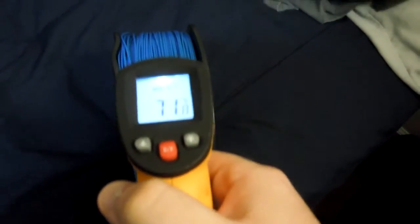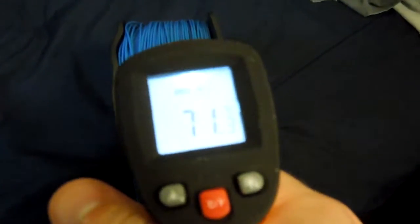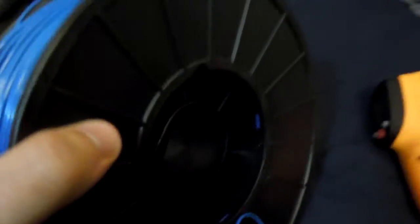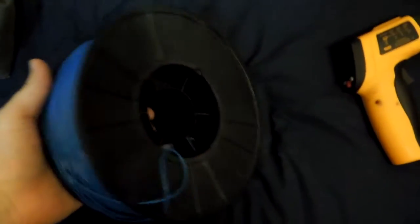If I pull the temperature — I just pulled it out — it got to about 90 degrees C in there, and the outside is a little bit more than that, but it's been cooling down. So it was about 90 degrees while it was in the oven. You can see that there's some deformation of the actual spool itself — it was sitting in the oven and kind of drooped down. Hopefully it wasn't enough to damage the filament; I don't think it was. Everything else seems to be fine, but the only way to know if it actually dried out is to load it up in the printer and see if it still does the pops.